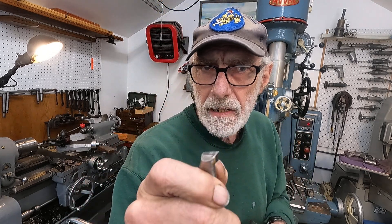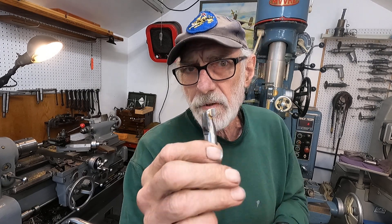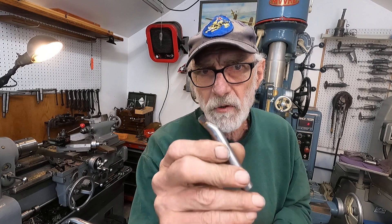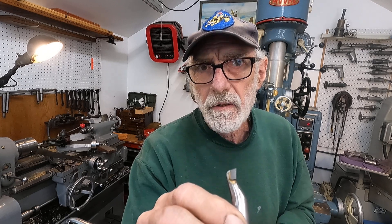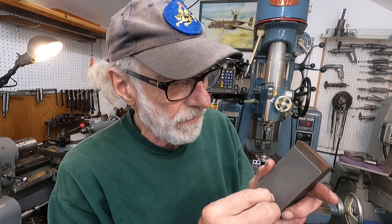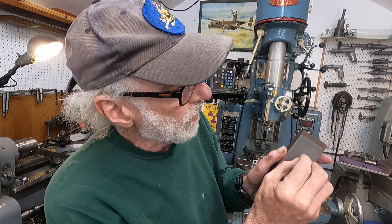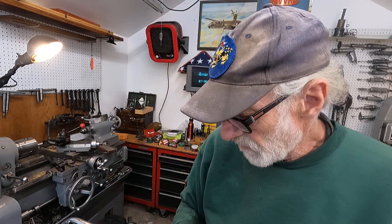This is one of the most critical things with a jig boring tool — to have a razor sharp tool and a predictable edge. I'm going to show you about aligning the tool in the machine. This is a critical part of using a jig bore because you may have to remove the tool to sharpen it and you want to get it back. If you don't get it back in straight, the dial on the boring head is not going to be as accurate as you want. I've got just a very, very small radius here, and I'm going to use the finest feed of the machine.